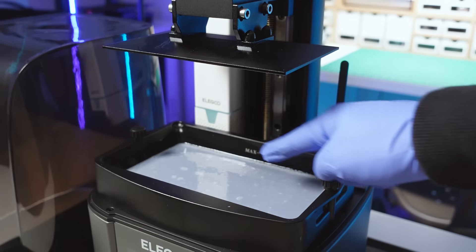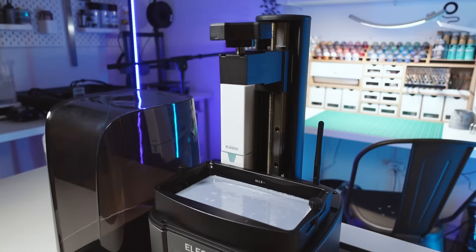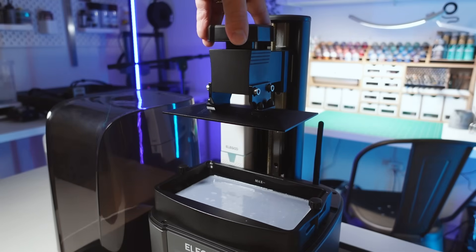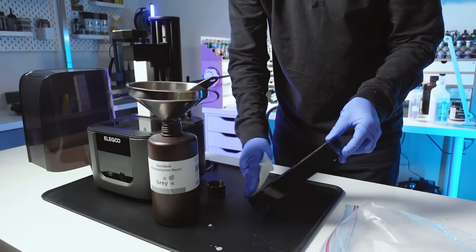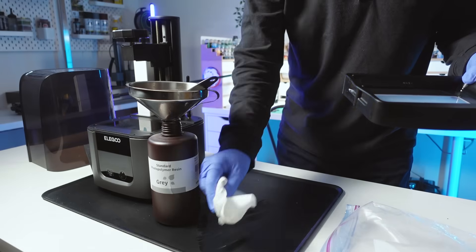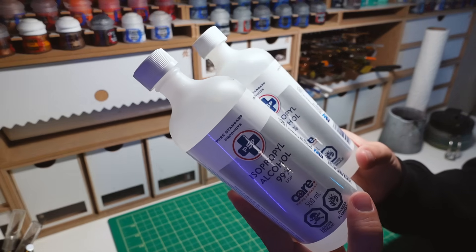The parts that touch resin include the interior of the resin tank, the bottom of the build plate, and the top of the build plate when it submerges. Everywhere else should remain clear of resin. Maintaining this cleanliness is important for creating a safe work environment and preventing your machine from becoming a mess. If an accident was to occur, don't stress — it happens. But it's important to keep in mind that water and soap does not work when trying to clean up your typical resin. You will need 99% isopropyl alcohol, otherwise known as IPA, to break it down.